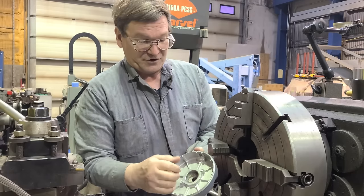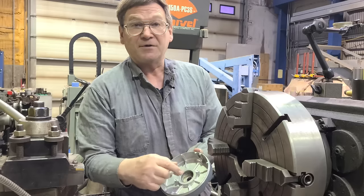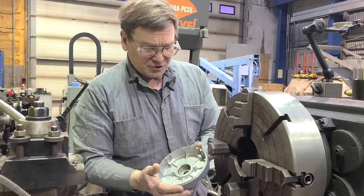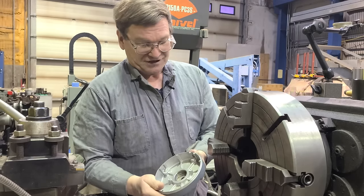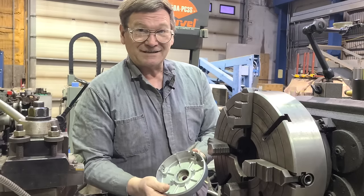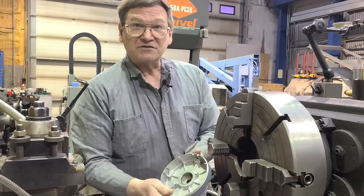There's a point where you're not going to sleeve it - if it was an aluminum one, which this one is, you're going to weld it up instead of just boring it out. Your smaller cheaper motors like this one may have a high percentage of zinc in the aluminum, in which case it's not really aluminum, it's more what you'd call pot metal, and it does not weld well - in which case you definitely would be wanting to sleeve it.